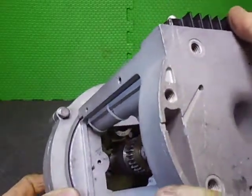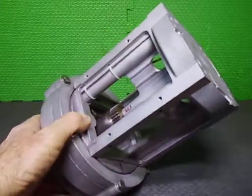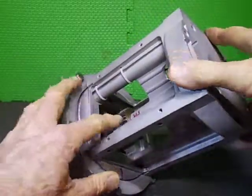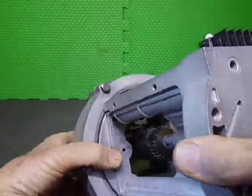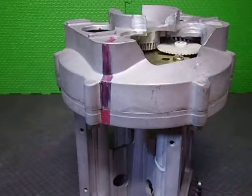The actual motor gearbox is reduction, but since the drive gear onto it is so large, it's sped back up again, and then reduced again when it gets to the top. So it's step up, step down, then step up, then step down again. There's a lot of gearing in these and a lot of moving parts.